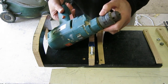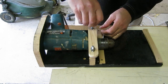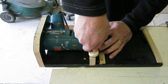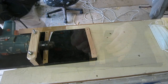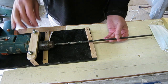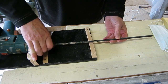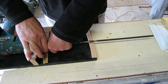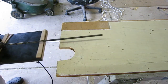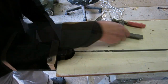This third method is my favourite that I'll use now. I made up a jig for my drill that just holds it flat, level, and securely. For a drill bit I use a piece of the spar itself — a length a little bit longer than half the full spar length — with some teeth cut in the end to do the cutting. The spars I use are Skyshark P4X wrapped carbon fibre; they're very light, strong, and resistant to splitting.